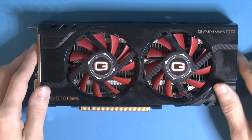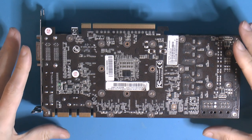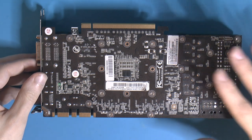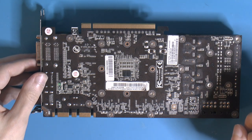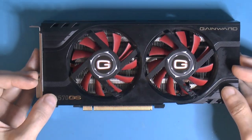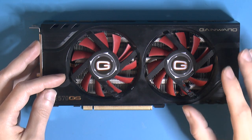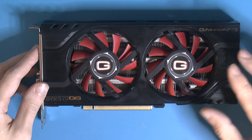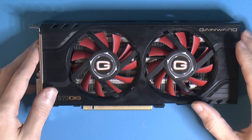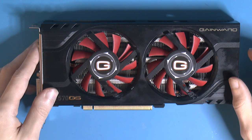So they're not particularly hot or noisy, but they were mainly based on the 400 series with the inferior heat pipe cooler and the first revision of the Fermi architecture. This later one, the 500 series Fermis, is less power-hungry, and you get more stream processors and so on. They had quite good compute performance, so most people preferred the 600 series that came afterwards. I really didn't, because I looked at benchmarks and didn't like the minimum frame rates, even if the averages were higher on the 600 series, and the compute performance was quite bad, I would say.